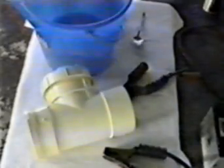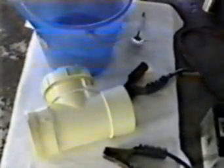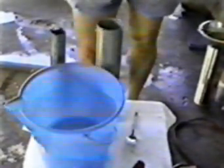Right. But if you wanted to run smaller ones and less current, then you go to putting floating tubes in. Centre mesh, mm-hmm. It gets it out heaps better than the solid centre as a negative. Mm-hmm. Solid stainless outside as a positive. Two is the best, two tubes, neutral tubes. Mm-hmm. Outside the mesh, and what's the gap on that? Yeah, it's approximately 6 mil, 5 to 6 mil.